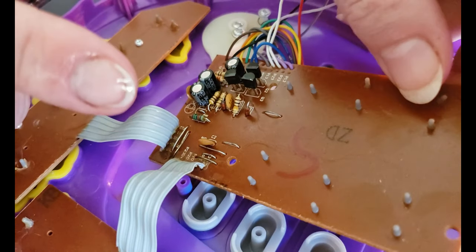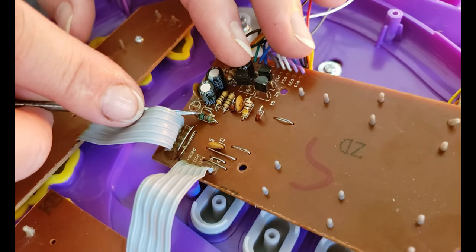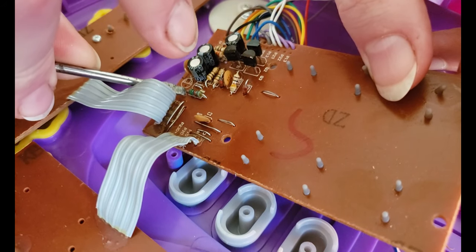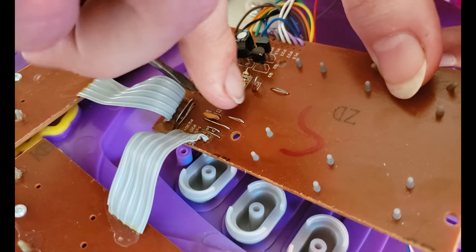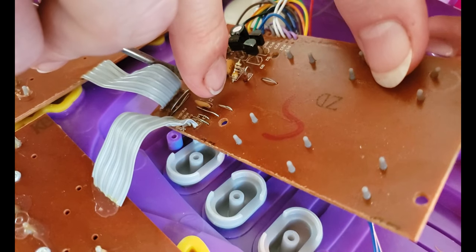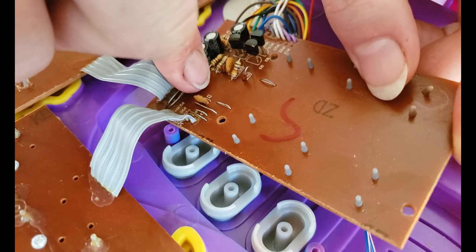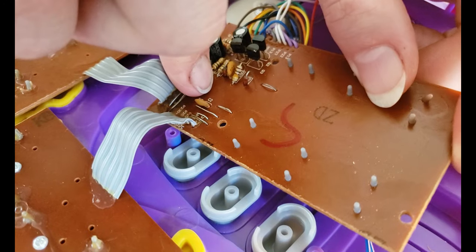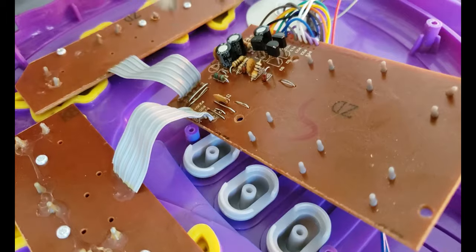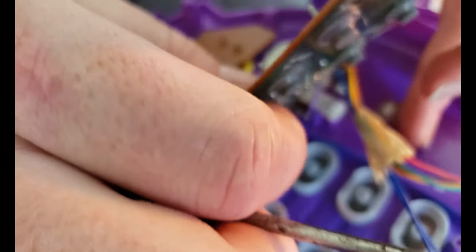you're going to do almost the same thing, except we're just going to isolate the resistor. I'm suspecting this one right here, just because of its placement. But just to confirm, we're going to stick this screwdriver on one side of this, and hold onto it with my fingers and allow this internal resistance and see if the tone actually changes. So you can see the tone is fluctuating, so this is a resistor we're dealing with, which we flip over and cross-reference on the other side.